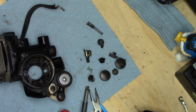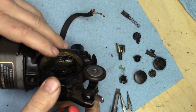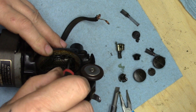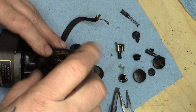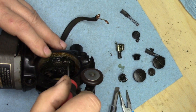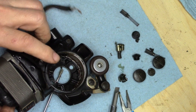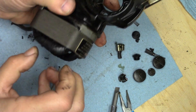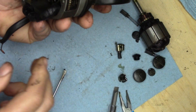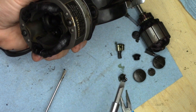Let me move this down a little bit. That cleared out, backed up a bit, and I'll back the other set screw up a bit as well. We will extract — and there we go — out comes the armature. And we have a disgusting mess inside which we're going to remove and clean out.